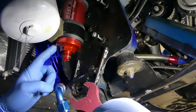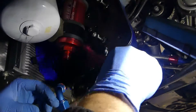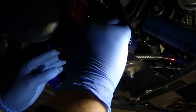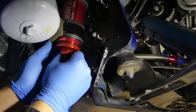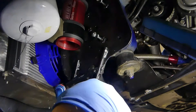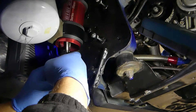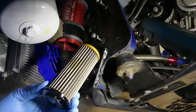Now I want to take the filter out of the Peterson — since it's stainless it's a dash-12. Oh man, that sucker's on there tight. There she goes — that dude's out. Then the spring comes out too. You've got to get a pair of pliers to grab it, because up inside there is where the actual oil filter is — grab it with pliers because it's on an o-ring, just pull it down gently. And that is the stainless steel reusable filter.